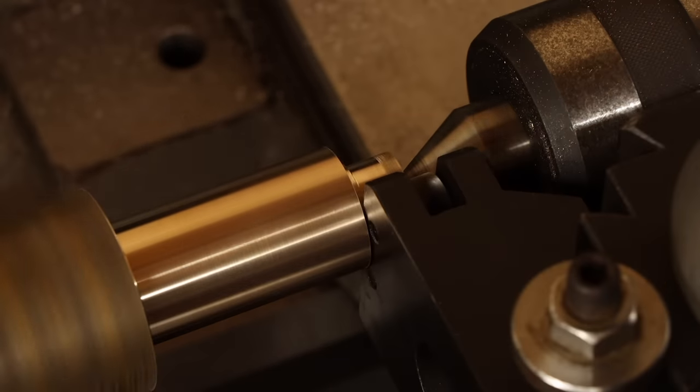I do have one last piece I need to make before I can call this complete. We already made the fine adjust knob — now we just need the screw. I'm looking to press fit the knob in place, so this diameter is roughly 5 thou larger than the hole in the knob. I still have to go a bit smaller for the threaded section, but since the stick out is so severe, the deflection is pretty extreme. To combat this, I'm taking three to four spring passes before measuring. The tailstock is perfect for pressing the knob onto the screw — it doesn't take much force at all and it helps keep the knob square to the axis. Last and final step is to face cut across the brass and steel at the same time to clean up the end. And with that, all the machining is done.